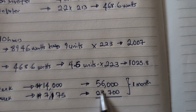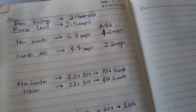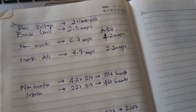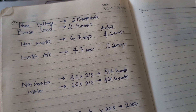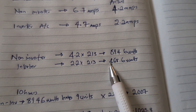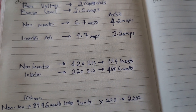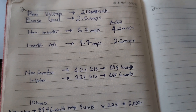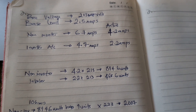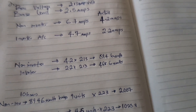If you're asking yourself whether to get an inverter AC or a normal AC, I think it's a no-brainer — unless you live somewhere where you're not metered and don't care about units. Because of the lower power consumption, I can actually run the inverter AC on my solar installation — practically all day — even with about 240 amp-hour batteries, running from night till morning. In the morning, my 4,000-watt panels are enough to fully charge the batteries. I hope this has been insightful. Leave any questions in the comments and I'll do my best to answer.